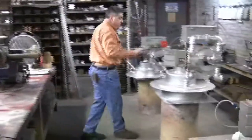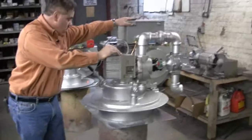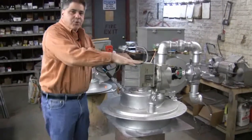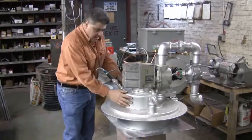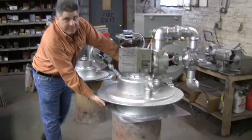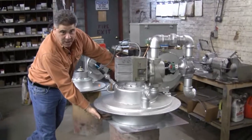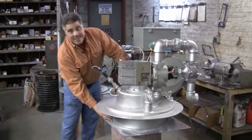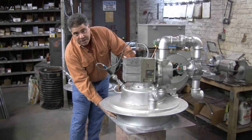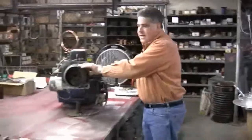What we're looking at here is an Infern-o-Therm 2.8 million BTU model 400 burner. This is a gas-oil combination burner. We use all UL approved controls. And as you can see, the air turret, this is a refractory poured gas base. High temperature refractory is poured, air dried, and then kiln dried. This protects the head of the fire tank, keeping the fire 5 inches inside the fire tube. The competition uses a thermal blanket. It's not as safe.